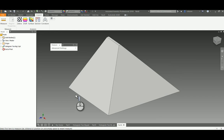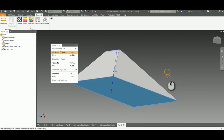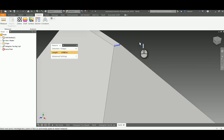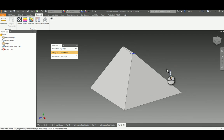The information you're going to need: the width of this is 2.7 inches, the distance across the front is 3.884 inches, and the height from this face down to this face is 1.892 inches. We also need to measure this block on top, which is 0.808 by 0.1 inches. Those are the dimensions you'll need moving forward.